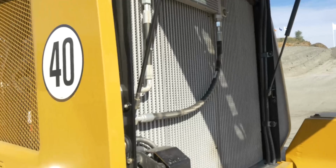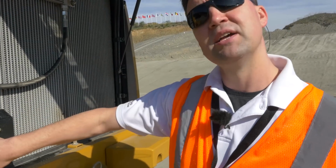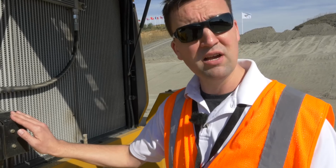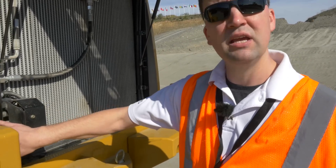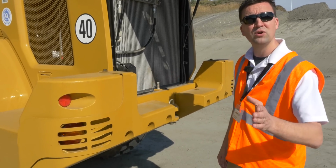Now, to protect you with our stage 4 emission compliant engines, even if you cut the master disconnect off, in the M Series small wheelers, we've got a keep alive system which will guarantee a purge of the diesel exhaust fluid, or the DEF, even if you turn the master disconnect off. It's designed to manage itself so you don't have to.